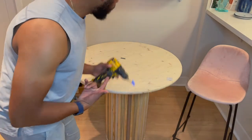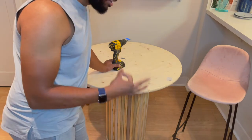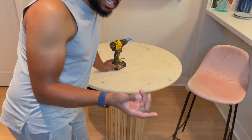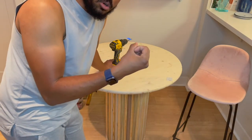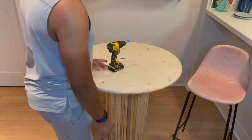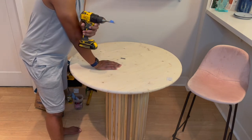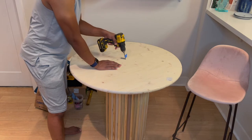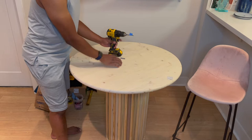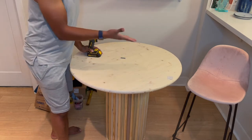The hole I'm gonna drill in the top arm is gonna be 3/8 wide. But I tried it on a dummy board and realized that the hole will still be too small. So we gotta kind of wiggle the bit in the hole to make it go through. For this, I'm gonna start with a smaller size. So when I do the bigger bit, the 3/8, it's going to be easier to go through the wood, instead of making a lot of splinters on the way down.